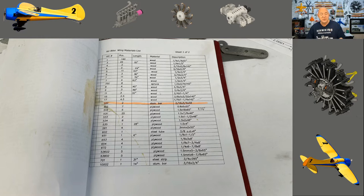Some of this stuff is a bit of a head scratcher. You're going to have to look at your drawing, identify that part number, look at the book, identify that part number, then think about how you're going to cut that part out. At a minimum you're going to need a band saw, a scroll saw, and woodworking tools. There are certain things I've used a lathe for, though you could use aluminum tubes that sleeve inside each other.